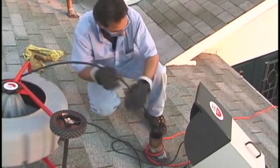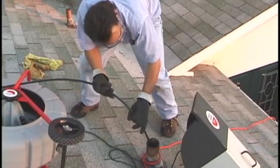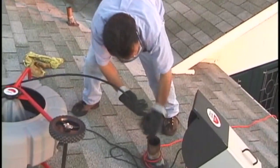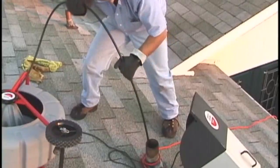Getting the camera through a fitting and into the portion of line you want to inspect can sometimes be challenging. If the shape, construction, or location of a fitting makes it difficult to get the camera through, there are a couple of techniques you can try. If you can build enough momentum with your push, you may be able to pop the camera through the fitting with a smooth, quick push. First, push until the camera hits the back wall of the fitting. Then grab the cable a few inches above the access point, pull it back another foot or so, and push in one smooth, quick motion. When using this technique, make sure to keep your lead hand close to the opening and guide the cable through the center of the access point.